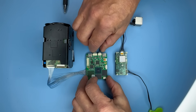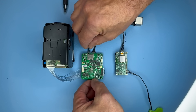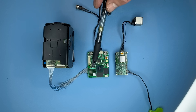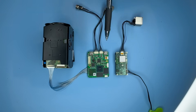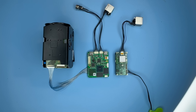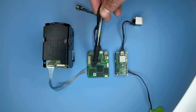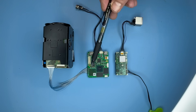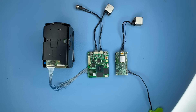The other feature of this zoom block product — if we turn it over — let me just show you on this side first of all. This is the standard version, and as you can see there is a space there for a BGA. This is designed for the Halo 8 artificial intelligence chip. So we do two versions of this product: the standard 1776 ZB, and then with this Halo chip fitted we can add AI functionality — we call that the ANT 1776 ZB AI. So the same board, just one fitted with Halo, the other one without Halo. When the Halo 8 is fitted, we actually ship it with some YOLO version 5 AI code, which is open source code.